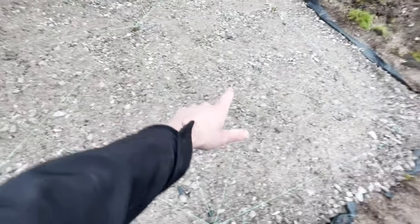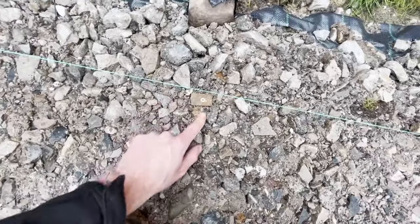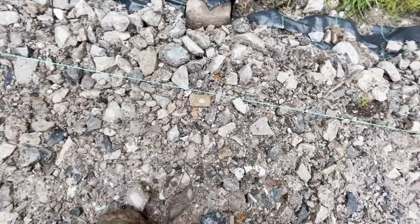I've made a cross in the middle — one line across here and one at the back. I must have gone over the peg with the wacker plate yesterday; tried getting it out but there's no chance. So I've been working around it in a bit of a weird pattern just to get an idea of what the lines are saying. We're still probably about 25 to 50 mil where we need to be, so let's start getting some hardcore onto this and leveling it off.